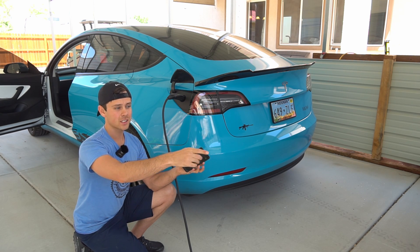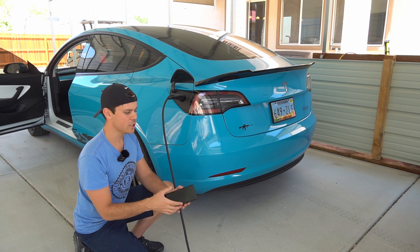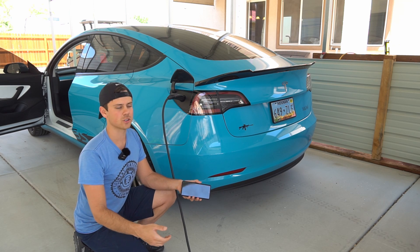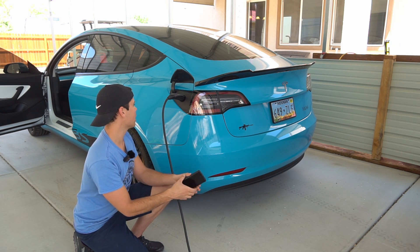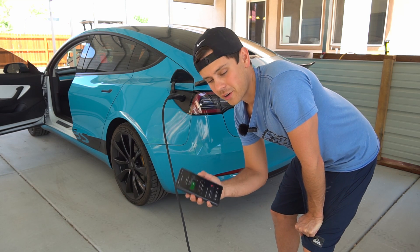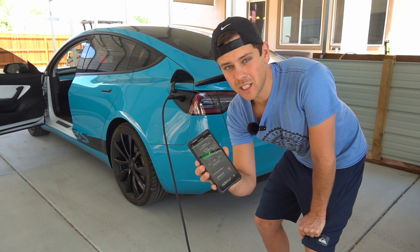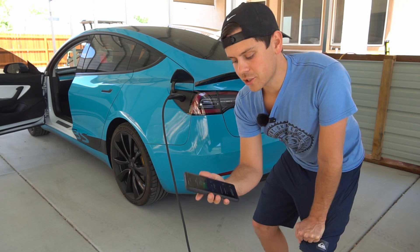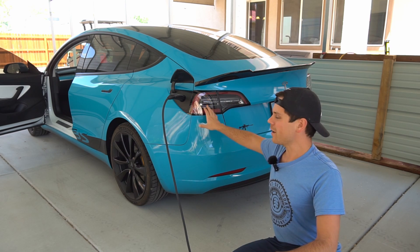This is a very cheap system — a $1,400 inverter, some $50 panels on the ground with about $50 worth of bricks. You could even use a smaller battery for this system, just make a massive solar array, and you can charge a Tesla — how cool is that? If I put two of these inverters in parallel I could actually have the full 32 amp output of this charger. Right now we're doing 17 miles per hour of charge and we've already added a mile of range.